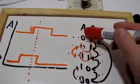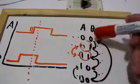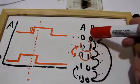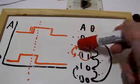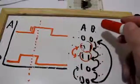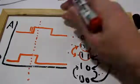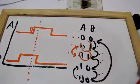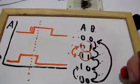You'll also notice that this is actually grey code — the numbering system where the difference between each consecutive number is just one bit. From zero-zero to zero-one, you change one bit, then the next, then the next, then the next. It's not extremely important to understand grey code for this application, but it does help you write slightly more economical code. But that's up to you.